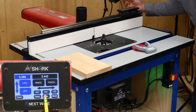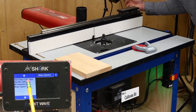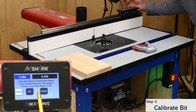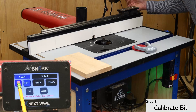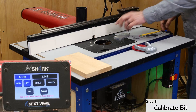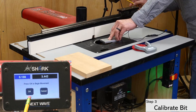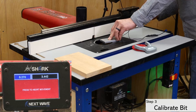Now open the apps menu and select the touch plate calibration, then select bit calibration. Click through to the white control button and use the down arrow to lower the bit below the table. Connect the magnet to the router bit or the collar. Click OK and touch the plate to the bit to verify that you have a good connection. Press OK again to proceed with the bit calibration. The bit will raise up, touch the bottom of the plate, and then go back down below the table automatically.